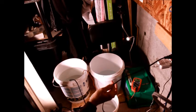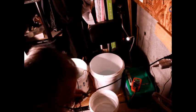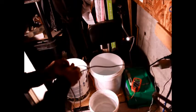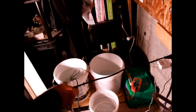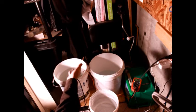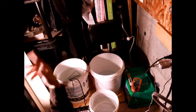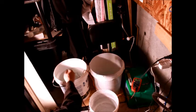There we go - I know for sure that has an open wire touching the salt water. There's no voltage being picked up, no difference between that and ground. But as soon as I drop that ground probe in - that's the point I was trying to make: you can have a defective open-circuit high-voltage pump running in your tank, causing heat, with copper exposed going into your corals, and it continues to run. If you don't have a ground probe in there, it's not going to trip.